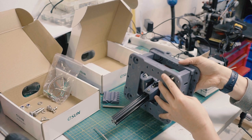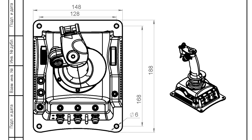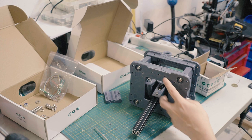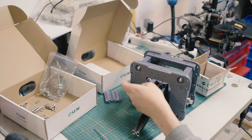The other thing is that these holes on the side here, or on the tops here, are spaced for the NXT spacing, which I don't remember the exact numbers are, but they're M6 holes. These holes here are spaced so on 40-40, like a metric aluminum extrusion, you could run bolts through the back of it for mounting onto there. And then these are extra M6 holes here for other mounting options.